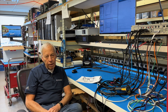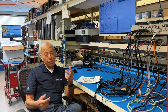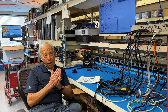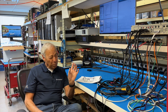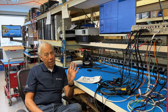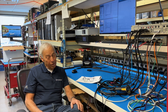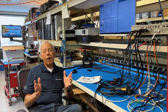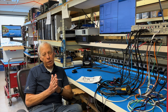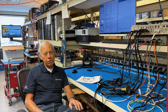So if you can get two 6-ohm resistors and put them in parallel, you get a 3-ohm. But if you can't, we're splitting hairs here. Two good resistors in series — I don't know how many people are really going to hear the difference, to be honest. That's the ultimate goal, to put them in parallel. If you can't, absolutely put them in series and I think you're going to be just fine.